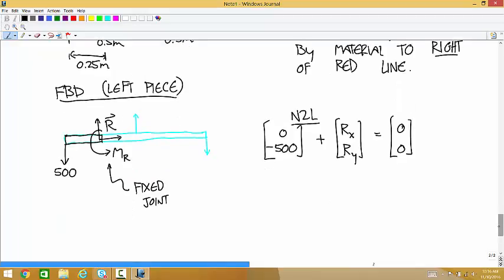And then I didn't write out rho and F and M. We could do it for this. This is just a rigid body problem, but since the beam is horizontal, we can just break it up into horizontal and vertical components. It's not too hard to just do in your head. So let's take this as our about point, and then the moments produced around that about point.